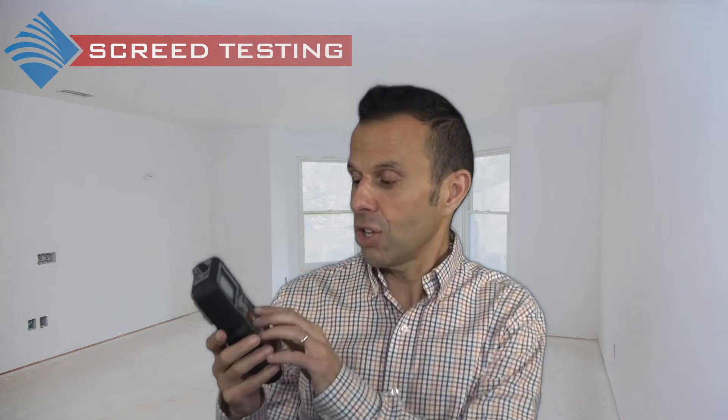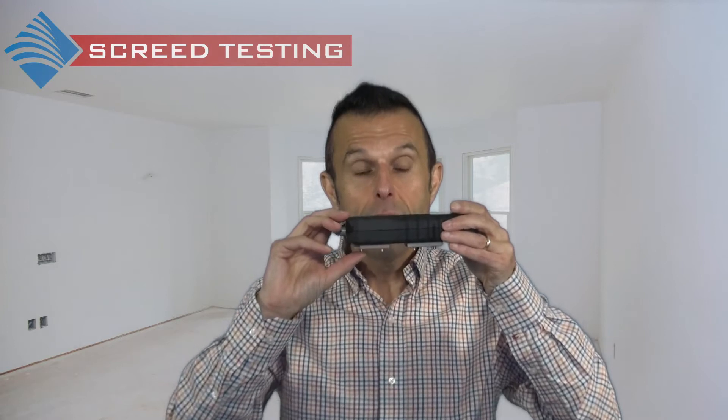Displayed on a large clear digital screen, the operating procedure when carrying out testing is to brush any dust from a smooth area of concrete and also from the electrodes. Switch on the encounter meter and place it firmly onto the slab, compressing the spring-loaded contact pins on the base. Read the moisture content from the readout.